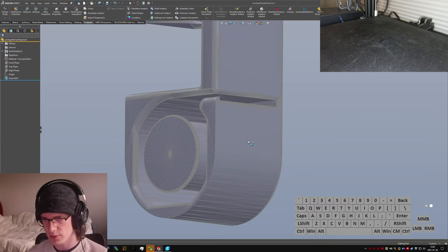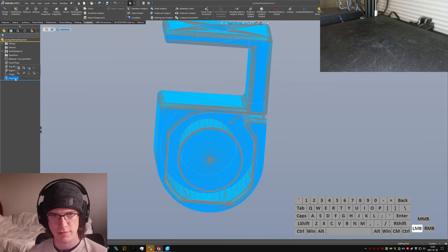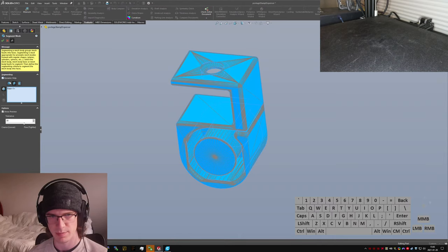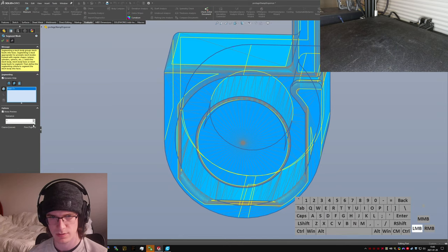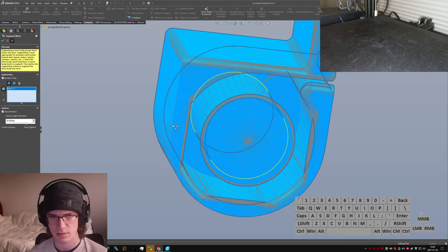For now, I think we can just hop to modeling things. So I've already imported the body. I haven't really done any processing on it yet, but I think the big tool here is just a big old segment features, and then pick things a face at a time to tighten up all your tolerances. Maybe keep them a little loose. Maybe I can group planar segments by grouping facets that represent planes? Let's not group anything. Oh, hang on. Now that one picks up the cylinder in the middle there. That's kind of nice.